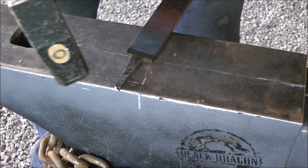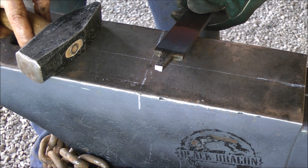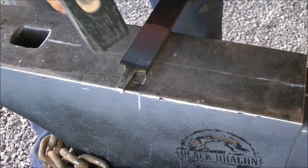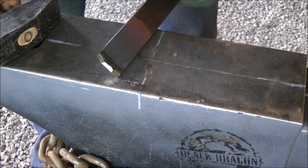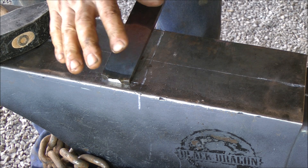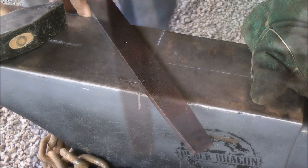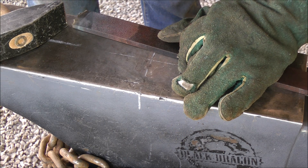So that is your first indicator that this steel is actually hardenable. Now, I can see from the overheating I've got a large grain structure there — don't worry about it, we're just testing the steel. So yes, this mystery steel, not being a file, is hardenable. Now I can use the other side of the steel to actually go and forge my blade. Remember, share your knowledge. Cheers.